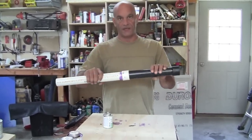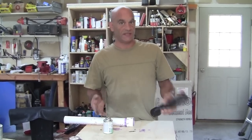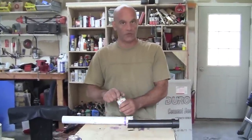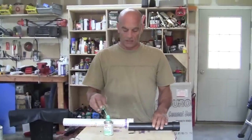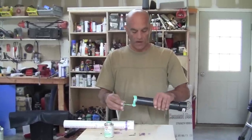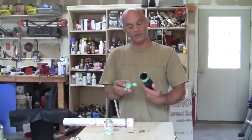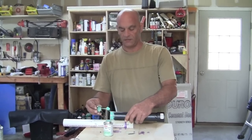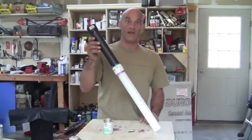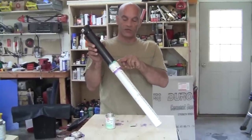But what happens when we want to connect the two together? You might think just use any glue — but no. Just like the purple primer lets the building inspector see the pipes were primed, when connecting PVC to ABS there's a special glue to be used only for that purpose. It's green — I like to think of it as lizard snot. No primer needed. Put a nice amount on — more is better in this case — and connect them. It's called transition glue, and it's green so the building inspector can see you used the right glue for the right job.